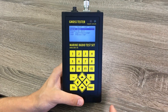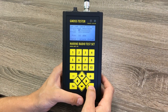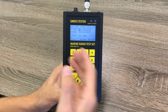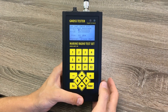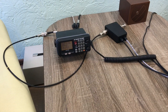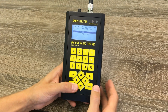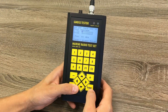Finally, we are going to send the distress signal to our station. We go to the send DSC menu and select the distress signal. We can input the MMSI code of the station using the digital keyboard, then set up the power level of the output signal and press Enter. The signal is sent, and we hear the station has received the distress signal. To be sure the station is receiving signals correctly, we can also send a test signal using the station's MMSI code.